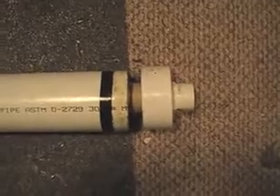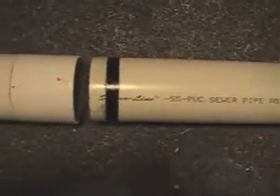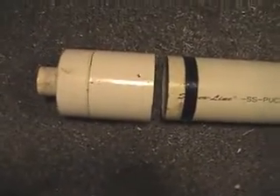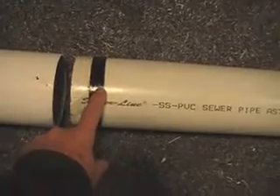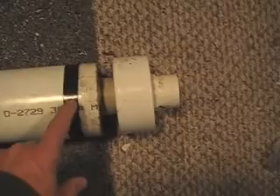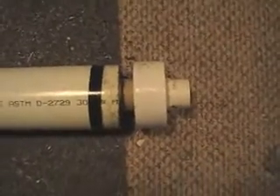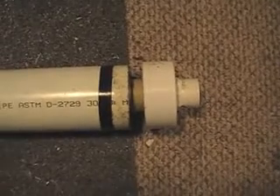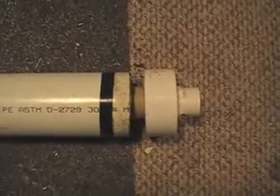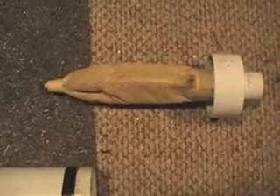What you're looking at here is the last filter in the system. I've got it laid out in an exploded format so you can see how the pieces fit together. Same as the other pipes with black tape being used as a gasket. Something I didn't mention - I do put a little bit of axle grease on the ends of all these pipes, including the tri-filters. You get a double benefit: it makes the stuff easy to pull apart, and it actually aids in sealing things a little bit too. Now the paper filter - the thing I like about it is it unscrews.